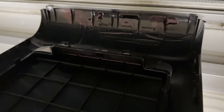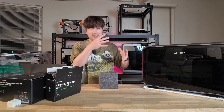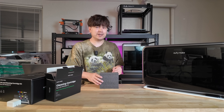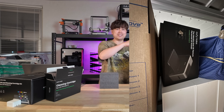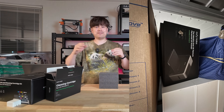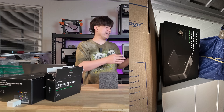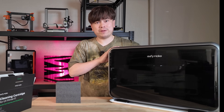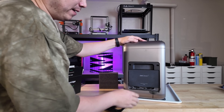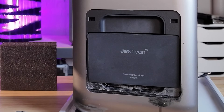Here's some more resin — you can see that leaked resin stuff. I loaded it into the moving van right side up because I know this thing has liquids in it and I don't want those liquids leaking everywhere. But the movers figured they could pack things more efficiently if they tipped it up on its edge. I didn't know this at the time, but when you flip this on its side with the solvent pack installed — the solvent pack used for cleaning the printer — it can leak. And that's what happened here.